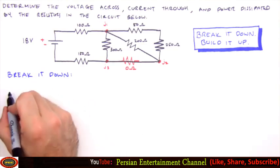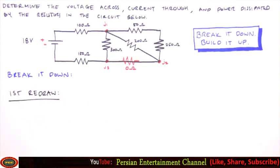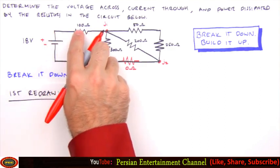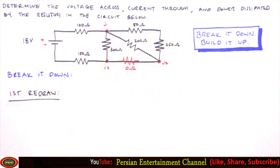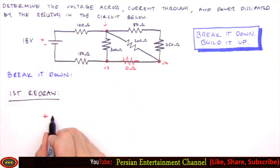We'll start by redrawing the circuit so that series and parallel relationships are readily apparent. There will be quite a few redraws. The basic idea for our first redraw is to convert our circuit diagram — which has a loopy current path clockwise from positive to negative — into a unidirectional one, left to right. Imagine grabbing the positive side of the battery with your left hand and the negative side with your right, then breaking the battery apart and stretching the circuit out onto the page. So we put the positive side of the battery here on the left, and after leaving it the current encounters the 100 ohm resistor first, so we'll write that here.